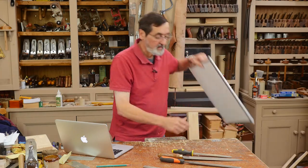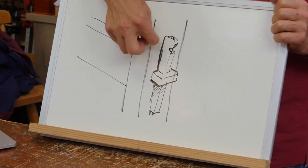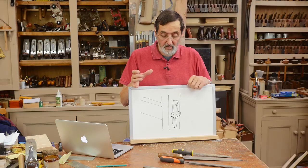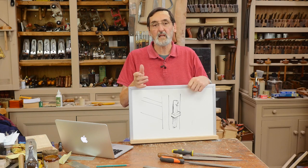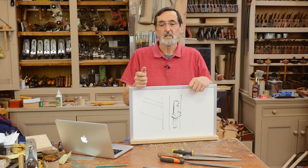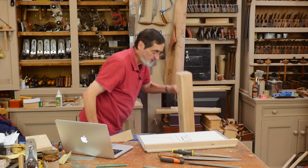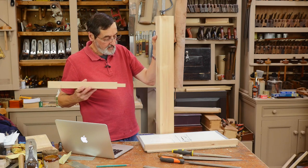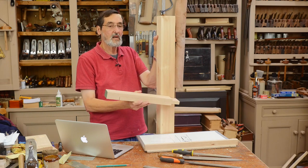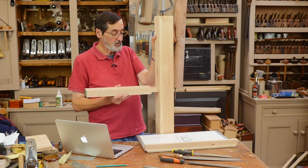And this is what a tusk tenon is. The reason it's called a tusk tenon is because of the tusk wedge. It's the wedge itself that's actually shaped like a tusk, not the tenon itself. But we use it on different applications than, say, for making doors, the corners of chairs, window frames, window sashes, and things like that. This is a different tenon. This is where we have a larger section of wood, maybe like this, where we have a leg, and then we have the tenon going through this way, and then we have a hole through the tenon on the exit side where we drive a tusk, a wedge, in the shape of a tusk, a walrus tusk. So this goes through, so it's very different.